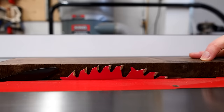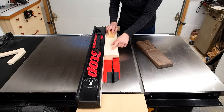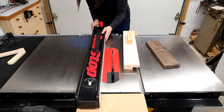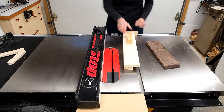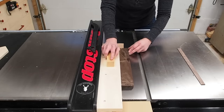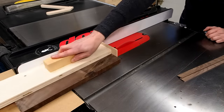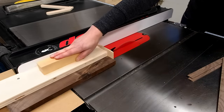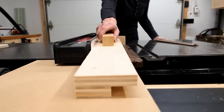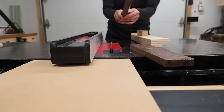I'm making sure my blade isn't too high, just the tips poking up above my workpiece. I'll set the fence to two and one eighths — two inches is the width of the jig and one eighth for the width of the strips I want to cut. Wow, this feels so much better. I feel safe and in control with the jig essentially covering the blade and the workpiece. Plus I barely have to push through the workpiece with my other hand, just letting the heel and the jig do most of the work. Definitely a safe and easy way to batch out thin even strips.